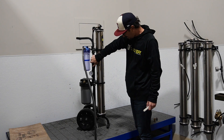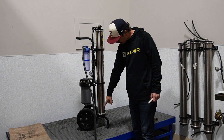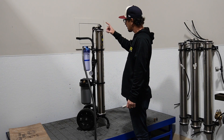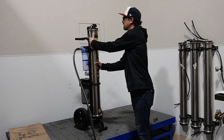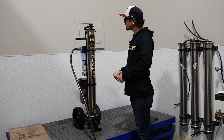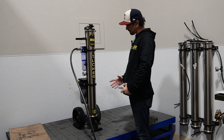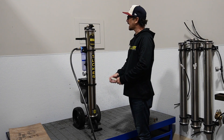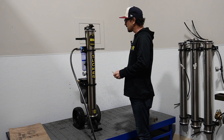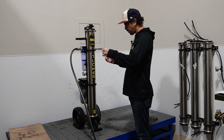So we'll go ahead and close down our bypass valve on our RO. You'll see the water at the bottom there will flow a lot less as we now are making water, and we will produce some up here in the RO port on the male garden hose thread. We'll take a moment for this to build up — it's got to fill with water to get to the top, especially being a brand new unit with a lot of air in there. So now you can see we're making water. We're going to test the water right out of that port right away.